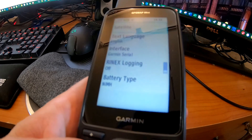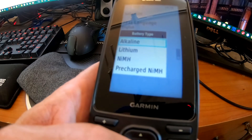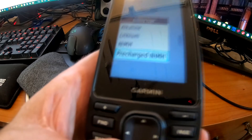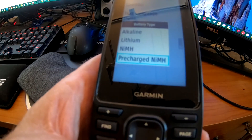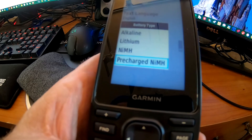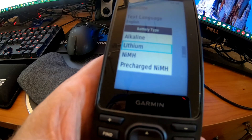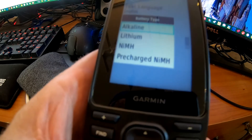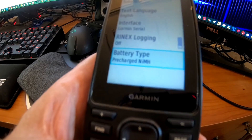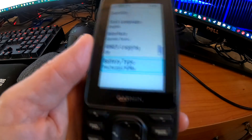Down here is your battery type. I'm using nickel metal hydride batteries, but you can also use lithium or alkaline. I usually use pre-charged NiMH — the fancy Eneloop ones. Those are called pre-charged NiMH and have different life characteristics than regular NiMH, holding a higher charge longer. Lithium batteries are good, but I've had bad luck with rechargeable lithium. I also carry a couple of alkaline AA batteries as backup. Switching to pre-charged NiMH should give us the best battery life and help the GPS manage its battery better.